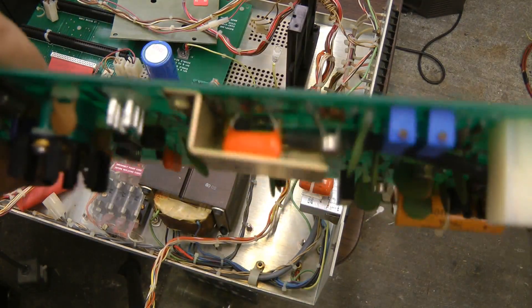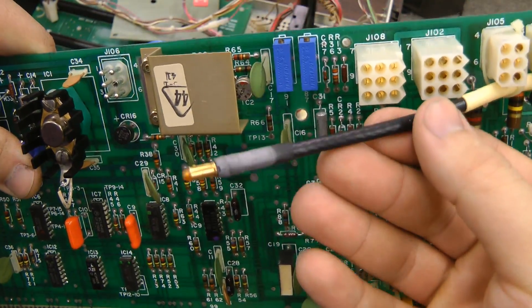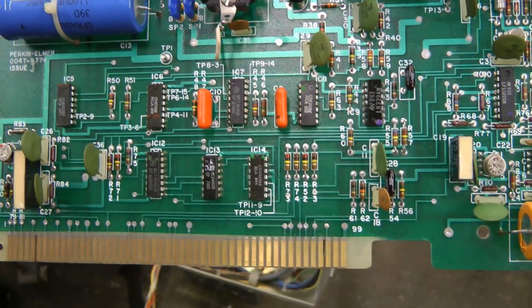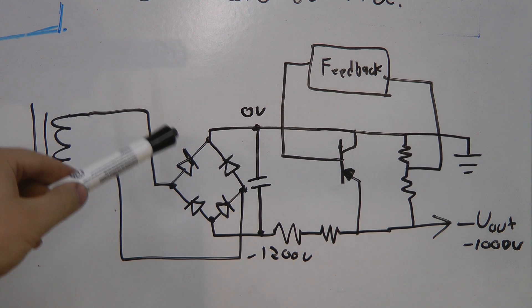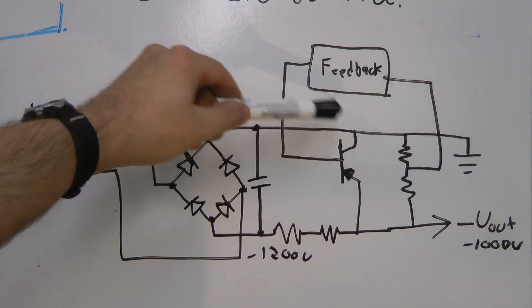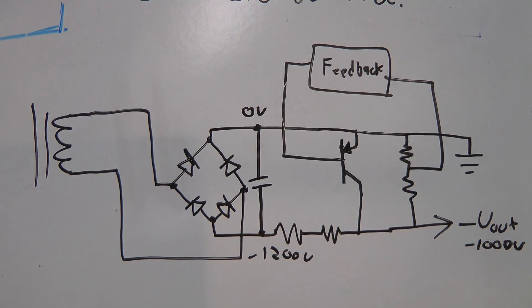The input from the tube is under this shielded can. There's a CA3140 op-amp — that's a 4.5 MHz FET input. The shielding — I think this might be a connector for the connection to the tube. That's just the coax and the high voltage lead going off to the tube. There's more power supplies up here, a bunch of 4000 series logic like NAND gates and NOR gates. There's a LM339. The circuit they have going on here to generate the high voltage: it's a transformer, rectifier, and cap to provide roughly minus 1,200 volts, passed through a resistor and a PNP transistor that will draw current to reduce the output voltage with a feedback loop from a series of resistors. It's a pretty simple way of generating a high voltage regulated supply for something that doesn't draw much current.